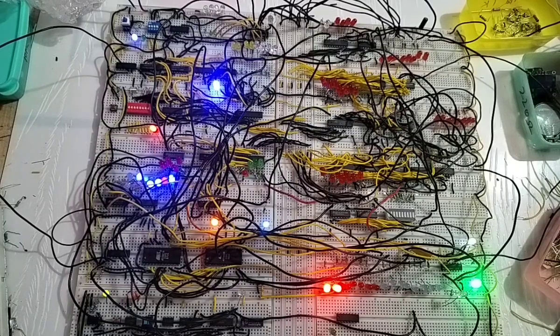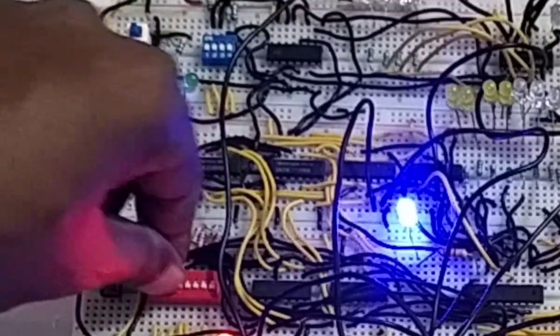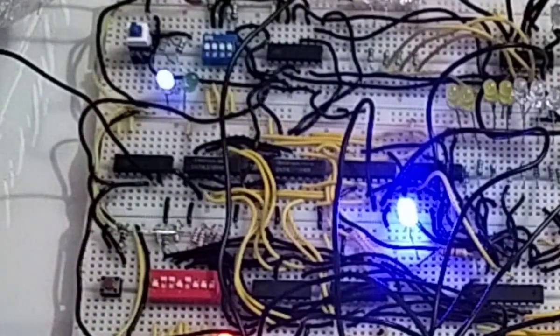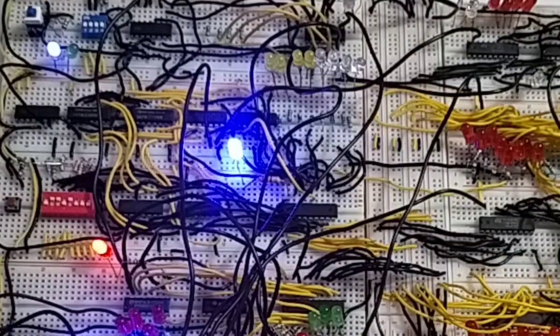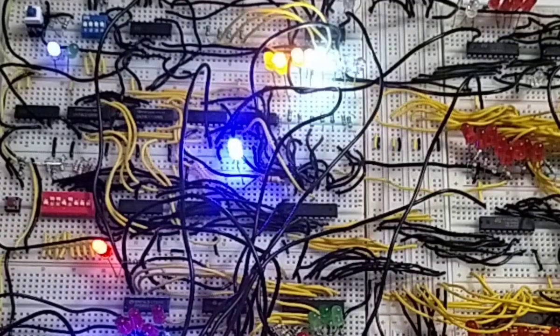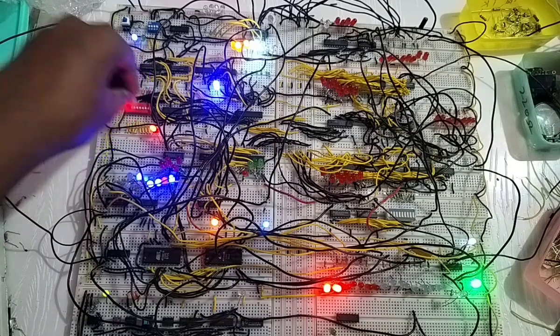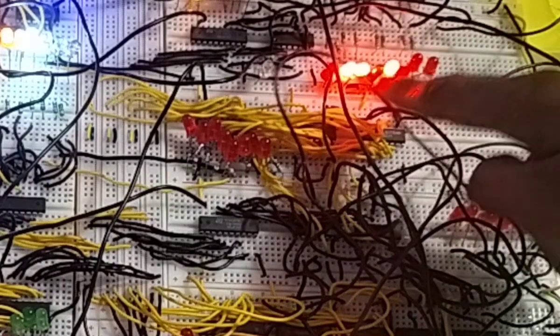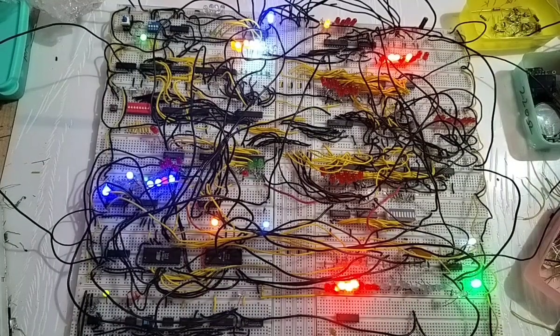Resetting the step counter. The step counter is zero; control signals are counter out and memory address register in. Now I am just programming this jump instruction and want to jump to address location 8. First of all I will jump to location 8 when this instruction executes — I just programmed this instruction into the RAM. Now let's check whether it is working or not step by step.